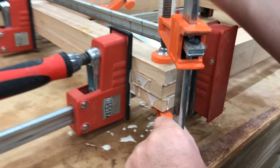The concept of using a shear web is one that I borrowed from airplane wing construction. In a wing, there are spars that span the ribs all the way down the length, and adding a solid sheet to them from end to end essentially turns that structure into an I-beam. I realize it probably doesn't make a lot of sense at this point, but I think you'll see as this structure comes together how the concept works.